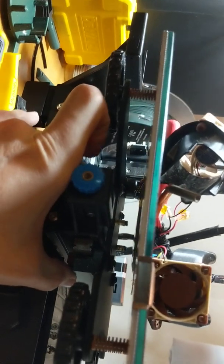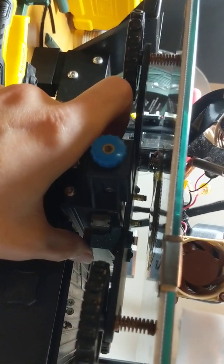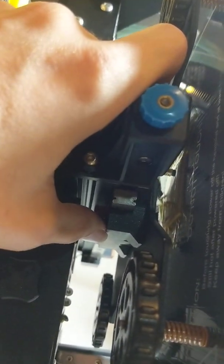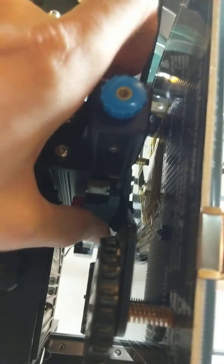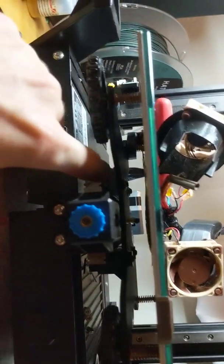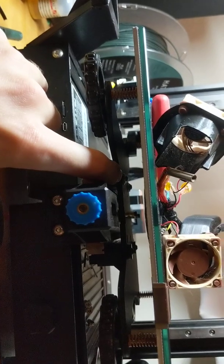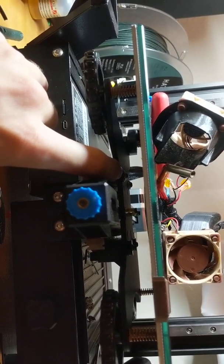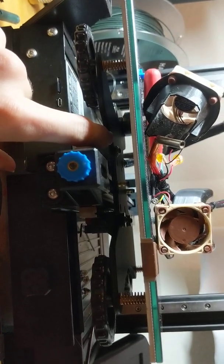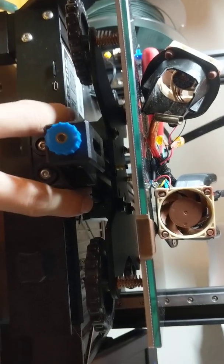I had to cut some relief into it, and on both sides I only screwed in the top two screws — if I screwed in the bottom screws it would squeeze and apply a torque, which probably means the tolerances need work. Not wanting to reprint, I just shaved things down and cleaned it up, and it runs smooth as butter. You put in two screws, tighten the fixed washers down, then tighten the washer stack — I have an M5, M4, and M3 washer stacked up to account for the offset and take up the slop. Dual linear rails are great.